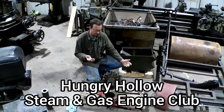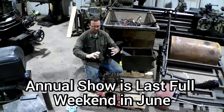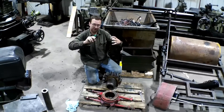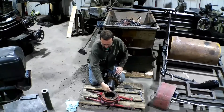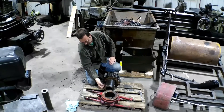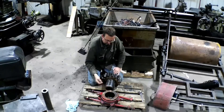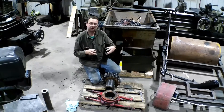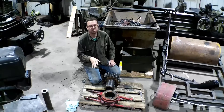They noticed a problem recently with the clutch. This gear goes inside with two keys, and it was rocking - the keys were rocking. Well, after a hundred years things wear out and this keyway is wobbled out. The one on here is a little wobbled but not bad. What we're going to do is take this into the slotter, open it up a little bit, put it on the Bridgeport and mill it out, get them to match, and then make new keys to hold it all together. Hopefully that'll cure this problem.